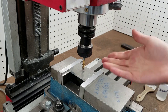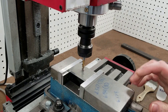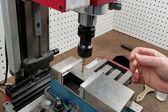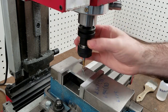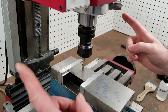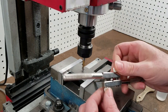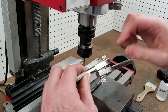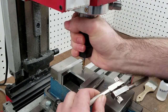Now, a pre-tapped hole, it's relatively easy to turn, but that's not always going to be the case, especially for larger taps. So my idea is to make a wrench that picks up these two flats right here. My original idea was to make something that replicates a normal tap holder. I guess sort of, 2 handles on either side, and then like an open-ended wrench, basically in the middle that would catch this and I could turn it.